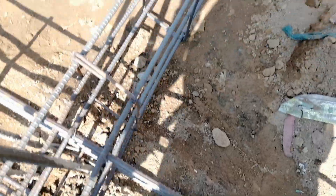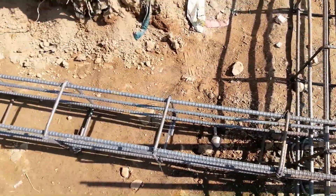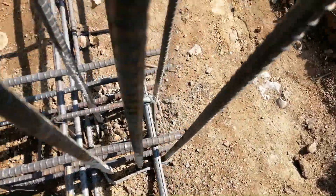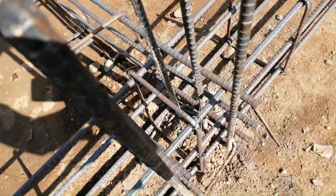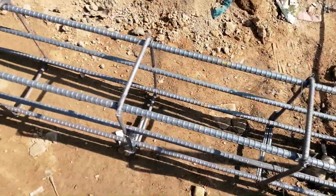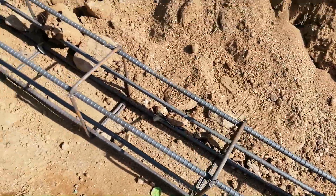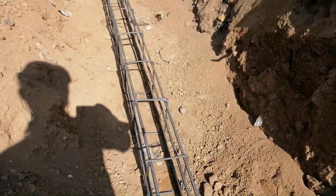Remember, don't waste your time and money, otherwise you will face more problems. You can see there is no development length for this beam, and at the junction everything is wrong in this plinth beam. The depth of this beam is 12 inches where it should be 9 inches.